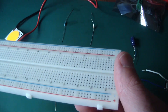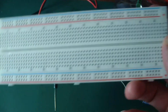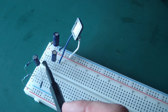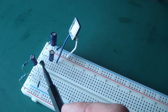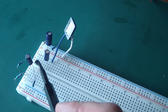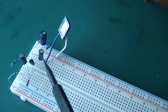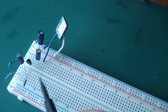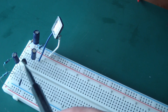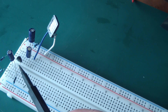We gathered up all our components for the speaker circuit and laid them out in the proper orientation. I'm just going to grab a breadboard and put all the components in and test it out before we do the final soldering. This allows us to get all the bugs out and easily add components and jumpers. So I got our little amplifier here — that's the BJT, Bipolar Junction Transistor — and that's acting as a dirty little amplifier. Here's a little speaker, these are capacitors and resistors doing capacitance and resistance stuff. All breadboarded up. All we got to do is feed it 5 volts in here, and then an input signal from the MSP430 brain box to actually make this thing vibrate.